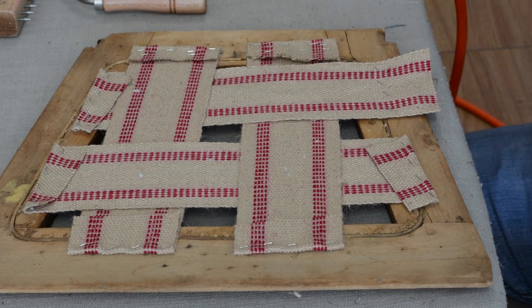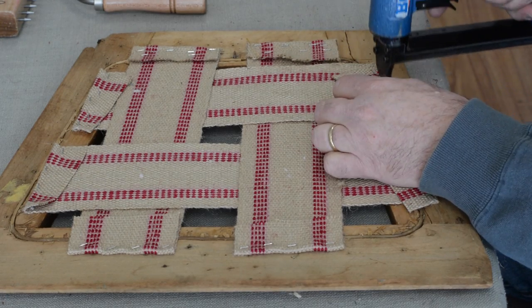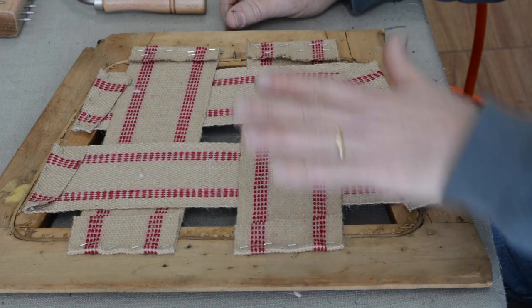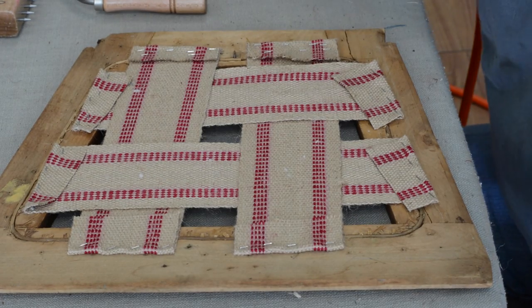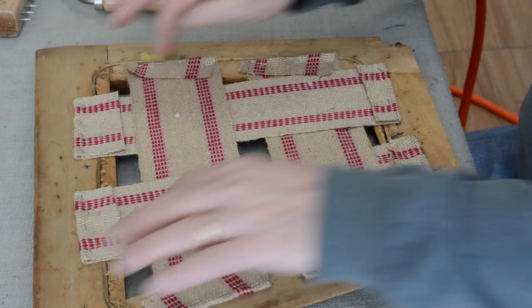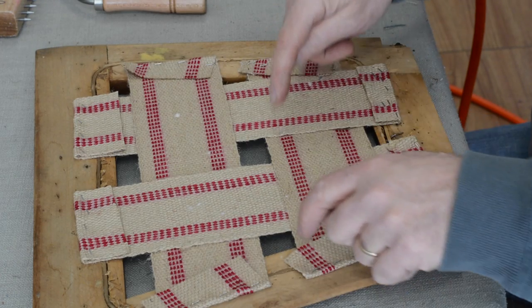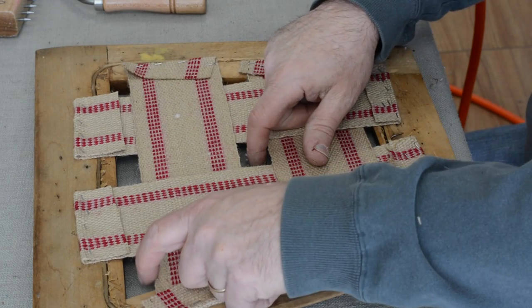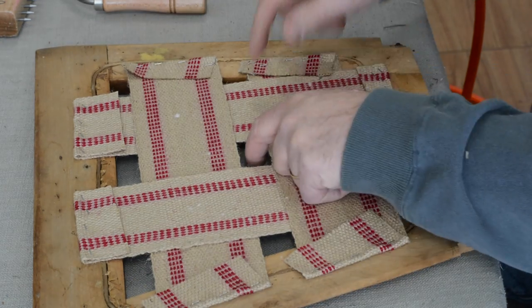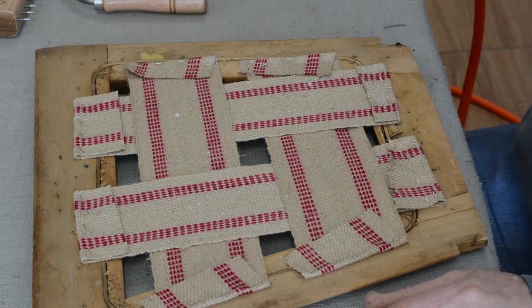Tight. Nothing like the traditional way of upholstering. This method that we're using is hundreds of years old, and in my opinion, they have not been able to improve on it. Now we're going to put some burlap, and the burlap's purpose is to fill in these holes. If you didn't use the burlap, folks, and the padding went all the way up to the fabric, in a couple of years you could play checkers on top of the slip seat. It'll look like a checkerboard because the padding's falling through in these openings. So you want to avoid that.